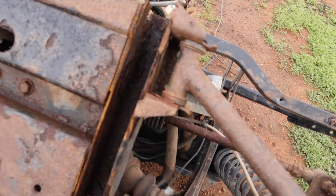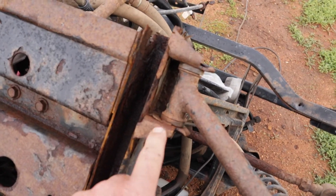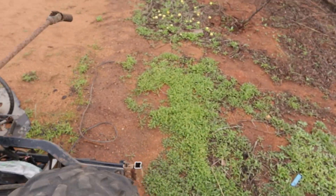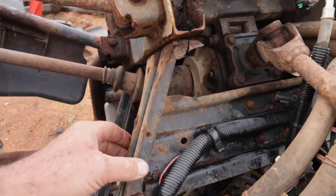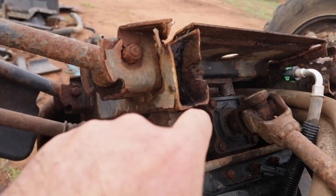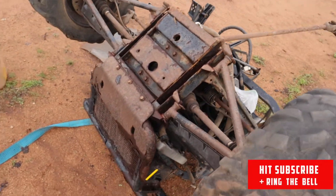I'm just cutting away. Basically this frame — I want to try and make new mounts for the lower A-arms, and I'm going to do that this morning, just out of some square tube. I'll just cut some 45-degree mitre pieces, then try and cut this main frame, this section through here, off. Then use this and weld it to the new chassis. Essentially this box section here will be the new chassis. Remember to like and subscribe if you'd like to see more of this sort of light fabrication stuff.